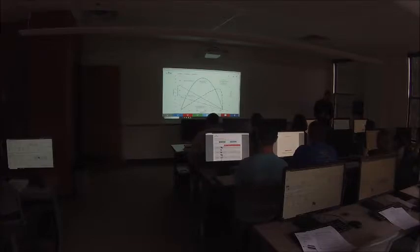There's another thing that's fairly important, and we're going to try to pay a little bit more attention to it this year because we've had some issues with this in the past, burning out motors because we tend to overload them. This dotted blue line here is the current that's being drawn. Okay. Now, notice, just like torque, it starts high and it decreases linearly with increasing speed. So you'll notice we've got two straight lines. Basically, that means that current and torque are proportional to each other.